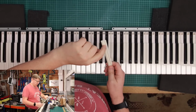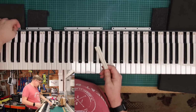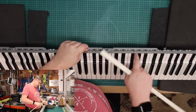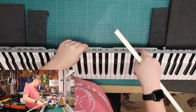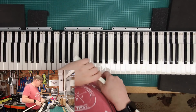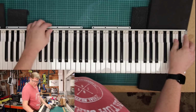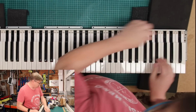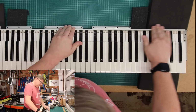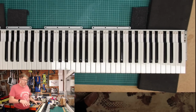and then it's got this kind of ridge on the other. And the way this goes on is the straight edge goes against the keys, and the ridge goes on the other side here. And as you probably can't see it on camera, but there are a number of kind of raised pieces along the keyboard. I'm sort of putting fingers on them now, and those are what this locks into. And it's very simple. There's a green mark there, and if I line it up with the green mark, as you see there's a green mark on here and a green mark there. Whether that was somebody else who's been in this keyboard before me, I don't know, but it literally just pushes back into place, and it locks all the keys back into place, which now means that the work on the key bed is done.